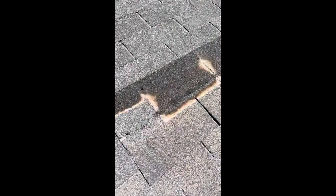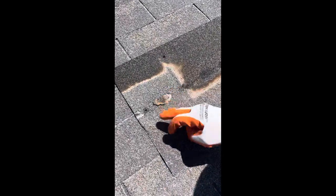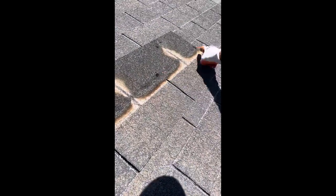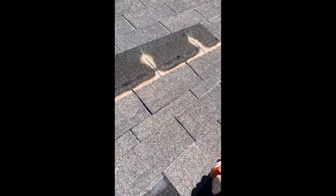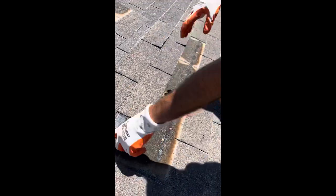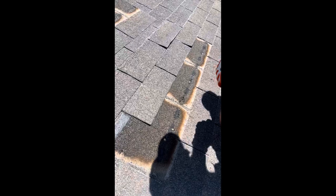I'm going to send that shingle in. We can see material transfer there — that's old, this one is new — there, there, there. We have a nail pop-through there and there. This is a fail of a repair. We're going to put in a temporary shingle for mitigation — temporary mitigation right here. And that's all.